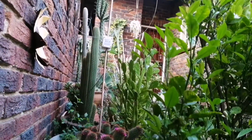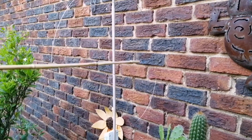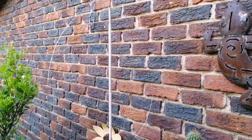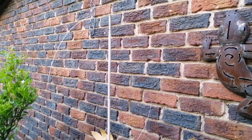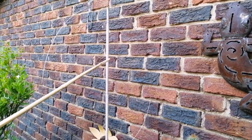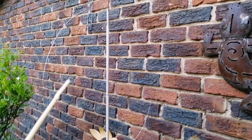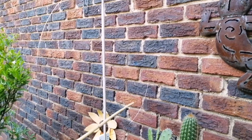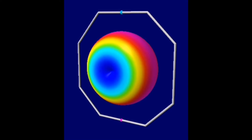The way this loop works, the flat side — the plain side — basically nulls out noise like RFI, unwanted frequencies you don't want to receive, because the loop is directional. Although I never turn the direction on mine, it seems to pick up what I want. If you imagine a sphere inside this loop, along the edges of that sphere on each side is where it nulls out signals and noise. My house is this way — that's where the electrical noise comes from — and the loop nulls out that noise.